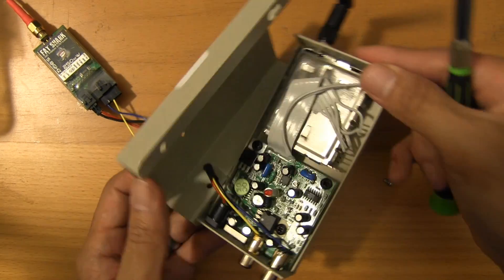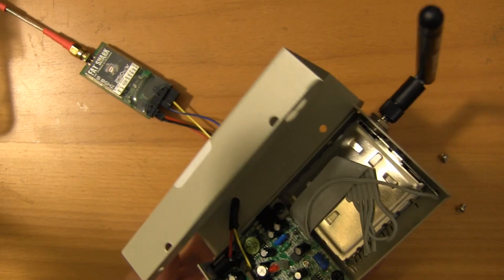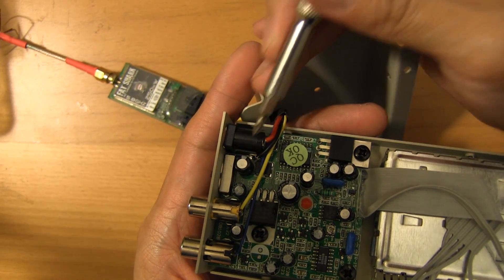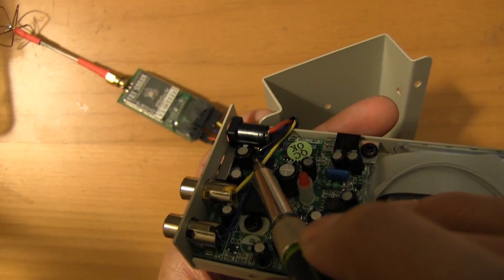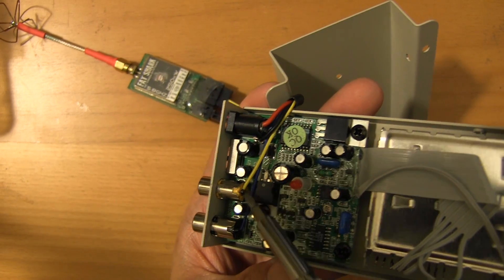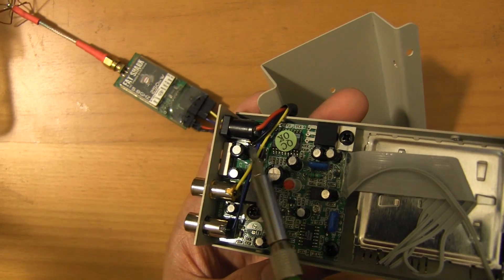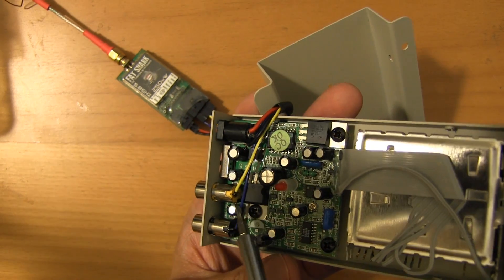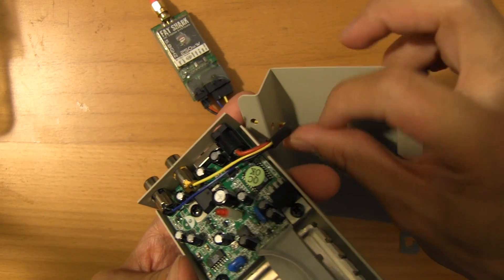Tapping the lines is really simple. All you have to do is take your four wires and solder them to all of the power leads. This is the barrel connector, the 12-volt barrel connector. The live or hot line goes straight into the center pin there, and there's just enough room on the side to solder to the ground plane. Yellow is video and blue is audio. It will help to have some flux handy because you may run into some issues with adhesion. Get a nice dollop of flux on there, pre-tin the pads, pre-tin the wires, and then just zap everything together. Make sure you add a little bit of heat shrink on the side to resist any fraying.